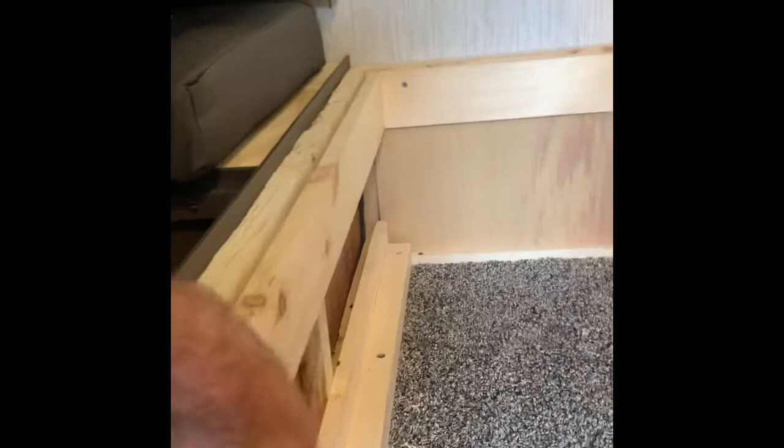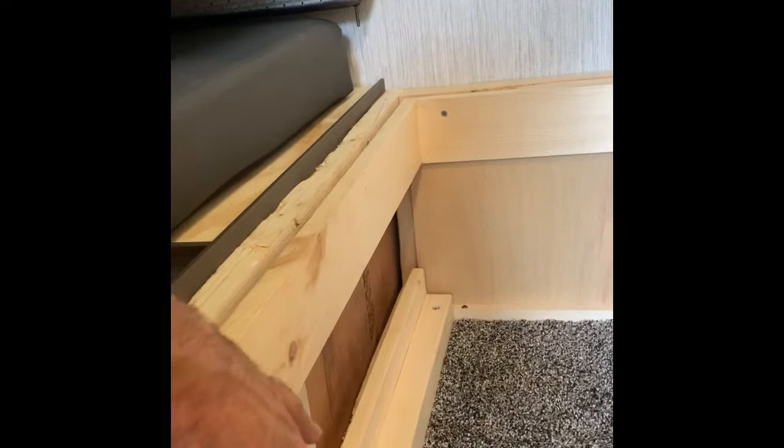You can put butcher's wax in here to make it slide — it's really pretty simple. At the top here I put another 1x4 around here, which makes it a little stiffer, but this also matches up with the top of the drawer to keep it from bouncing up and down. There's a space right here that allows it to not move up and down too much. It's definitely key to measuring and making sure everything is tight.